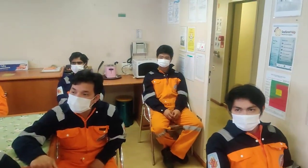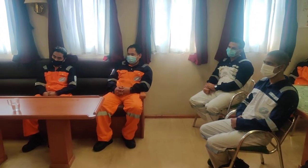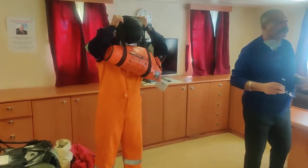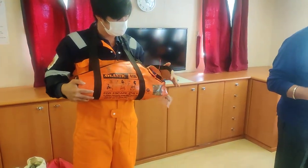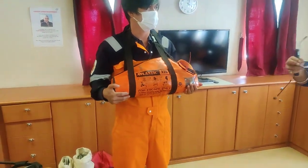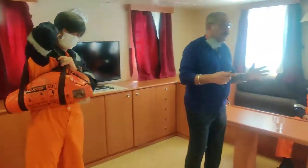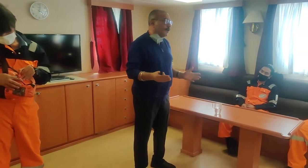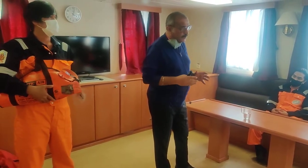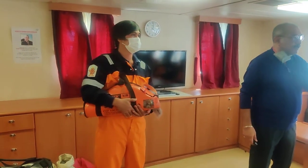Suppose you go into a tank where there may be gas. There may be a problem that you may encounter with your breathing. So what you do is hang this on your forehead part and shoulder and keep it ready, so that in case you have to carry out an emergency escape, this is sufficient. How many minutes is that, Chief? 15 minutes. So 15 minutes will be sufficient for you to escape from the enclosed space or wherever you are working. Whenever we have any doubt that the space where we are going to work might have a gas pocket, though we carry out all the gas checks as per the enclosed space entry permit.